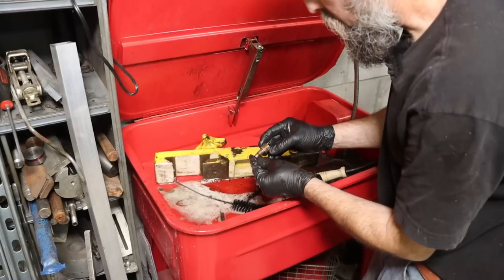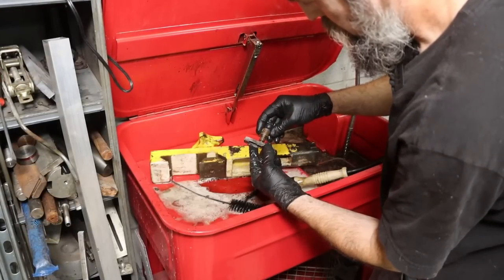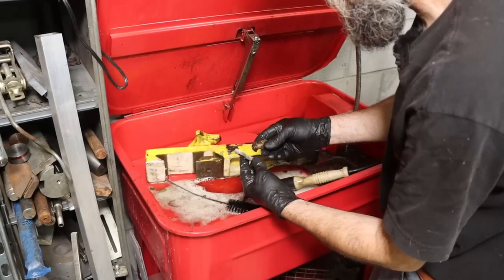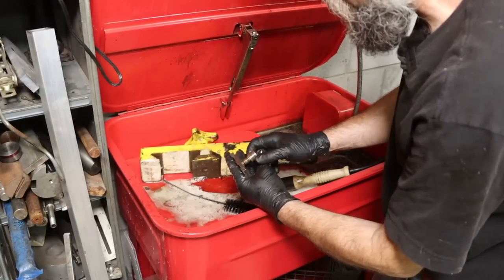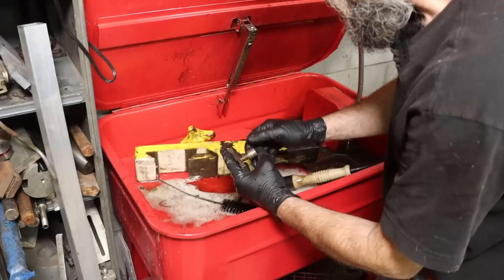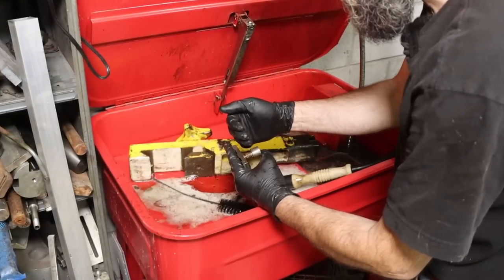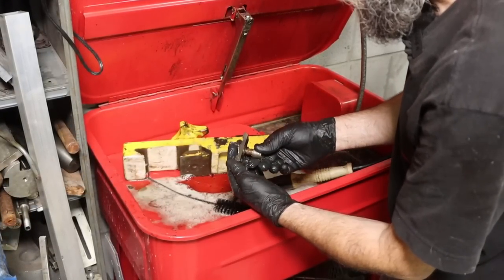So there's the adjuster nut and the spring washers. And those spring washers, as you push, they kind of, well, in their name, spring washers, they load. So it's not just solid. When you snug this down against the blade, it's not completely solid. And if you do pass a warp, a piece of warped where the blade's welded, it has a little bit of give in it. And that's what those spring washers do.